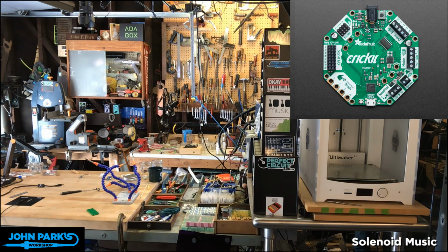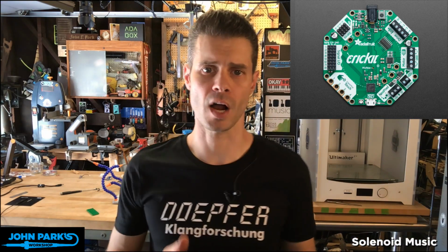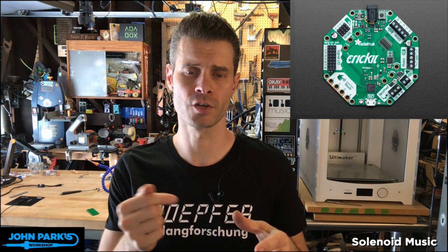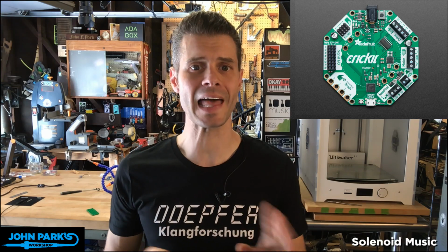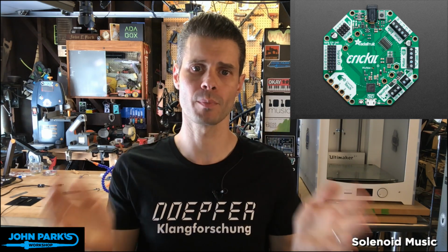But yeah, you can use solenoids for little latches. There are at least 2 or 3 projects in the Adafruit Learn Guide that will show you how to build different types of drawer latches and treasure chests where the unlock mechanism is pulled with the solenoid. The thing about solenoids is that if you don't get a latching type, you don't want to try to energize them for long periods of time.